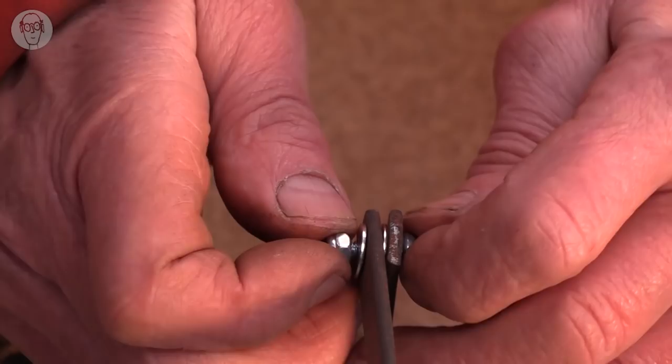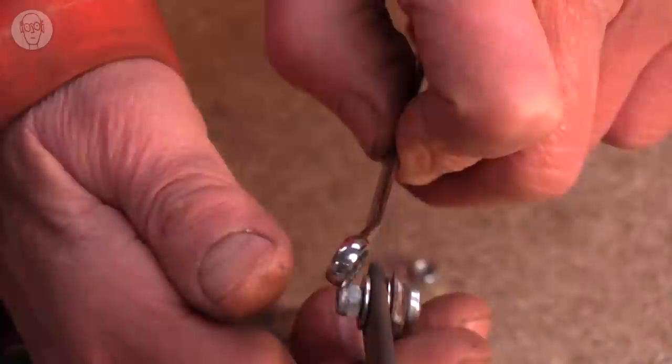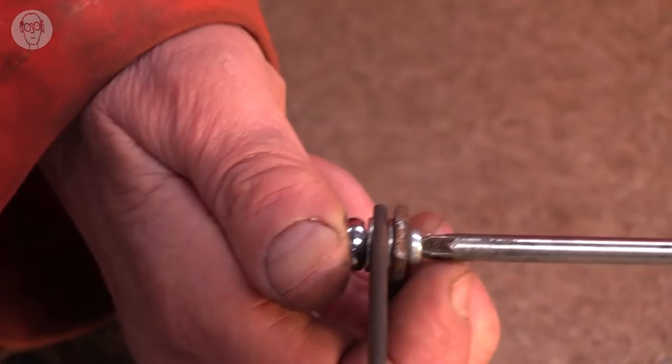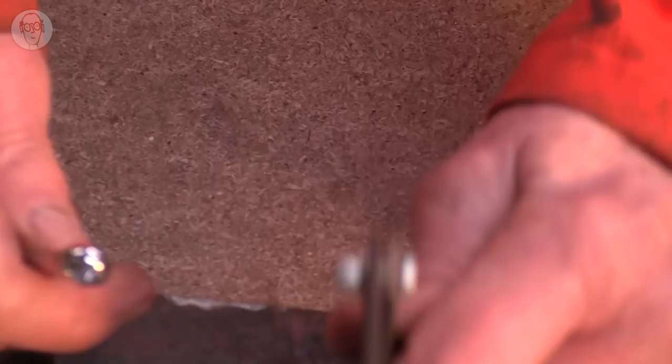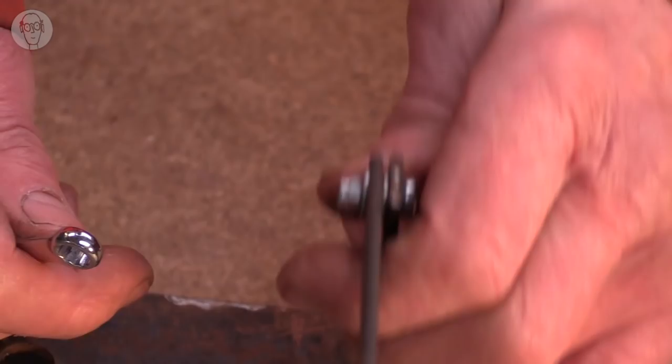they stiffen up the nut so that it won't just work loose as an ordinary nut would do used in this way. So then I just tighten it up as much as I can, and then just slacken it off a little bit, and then you've got really quite a stiff joint. The rest of the mechanism is still wobbly, but this particular bit is working much better.